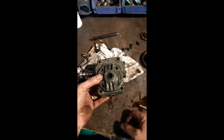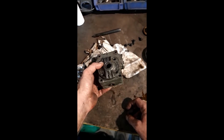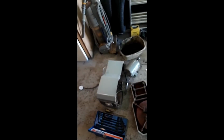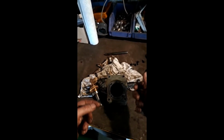But then I'll be mounting the motor that way rather than that way. Therefore it'll still graft. That's the plan anyway. Worst case, if I can't for whatever reason, all I do is change a wire over in the plug and that motor will go in reverse, therefore making this go in the right direction. So that's what I plan to do. Try and knock this out, put it in the other way, see if it turns. If it does, happy days, get this mounted on upside down to what it was, and voila, it should graft.